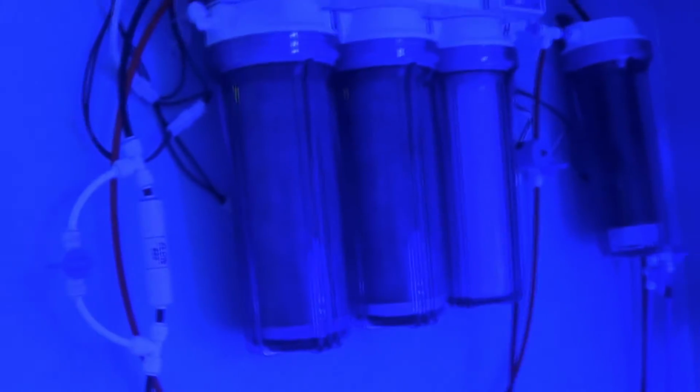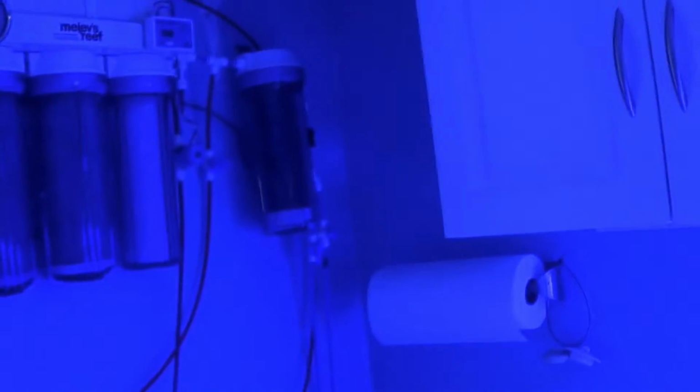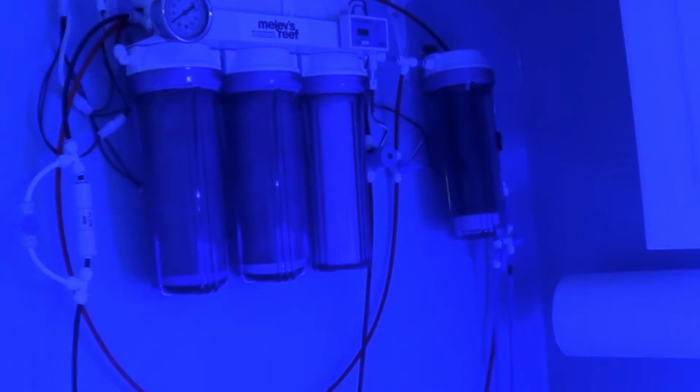Typically I flush for the first 4 or 5 minutes, maybe not even that, it's probably exaggerating. I switch the valve open, I close all the other ones, and I drain and flush that entire system, really until the pump starts to suck dry a little bit. Then I crank it back open and I float, and I actually have a tee off here. You may notice I've got a drinking spout, so I actually fill up my own drinking water. It's a 5-gallon water cooler jug.